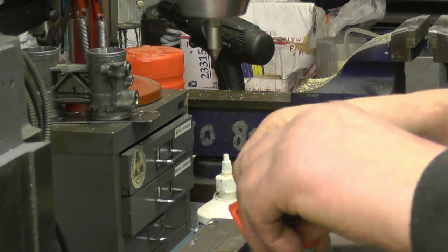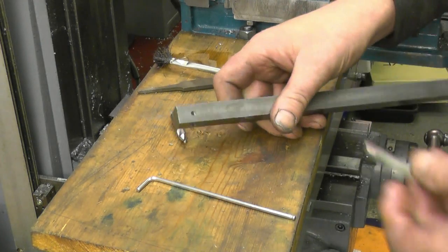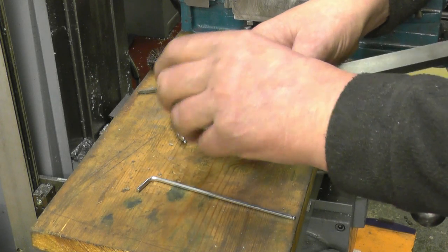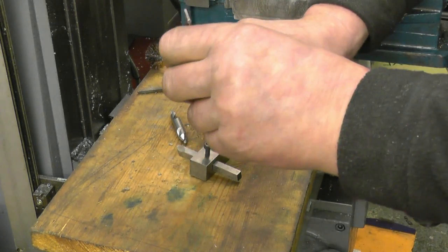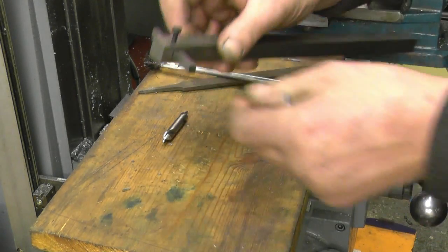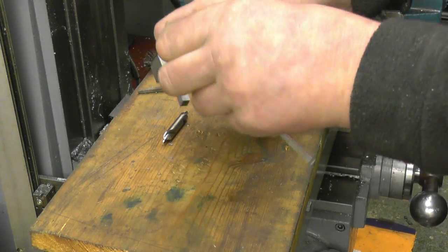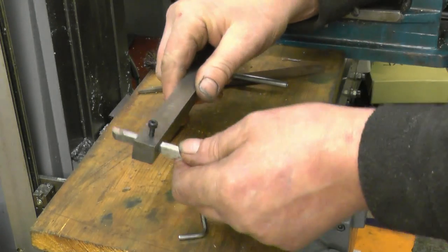I'm going to put a little tap in and we'll drill back to where it lives. I have to file a square hole, then we'll drill and tap that 4mm, put a lock bolt and go in there. It's a big hole with a screw cutting so I've got plenty of room. There's a bit of movement in there so we'll have to make sure we get the tool set up 90 degrees to the bar. That's going to make a nice, stiff threading tool.